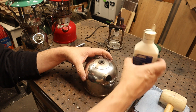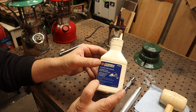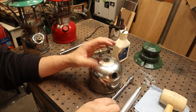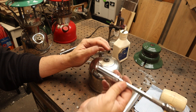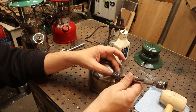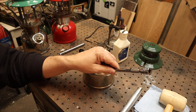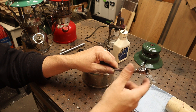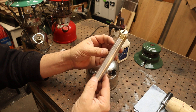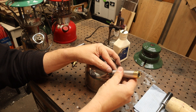What you want to do is use something viscous. This here is pneumatic tool lubricant — it's like an oil, pretty viscous — and you pour that in. Put about an inch worth of lubricant in there. You could use something like a socket, wrap that in plastic to make it really tight, put something on the end, and then give it a whack with a mallet and push it through. What I've done is something even better: I've turned down this piece of aluminum and it fits perfectly in here — really, really tight.